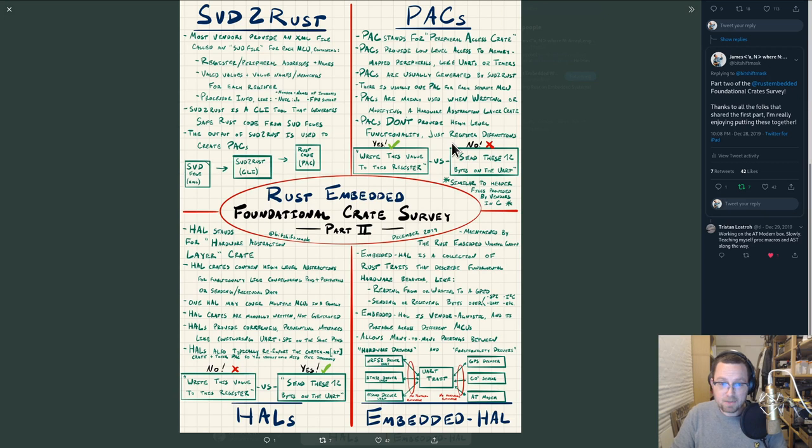So what I'm going to be doing today is taking it from a hard-coded driver for the NRF52, and instead using the interfaces that are defined in the I2C traits in Embedded-HAL. This means I'm creating what's called an Embedded-HAL driver. It's a driver that depends only on Embedded-HAL, which means anyone, whether you're on a Raspberry Pi or any platform, should be able to use this driver, and it should work just the same.